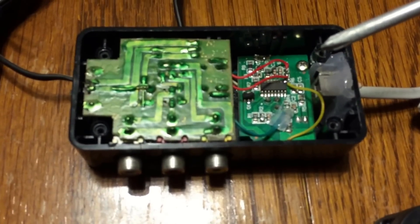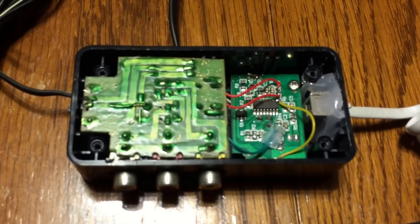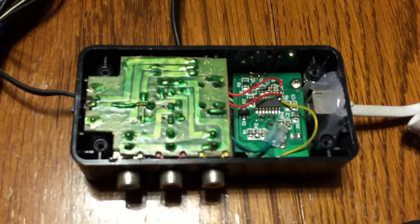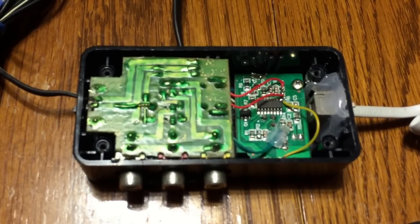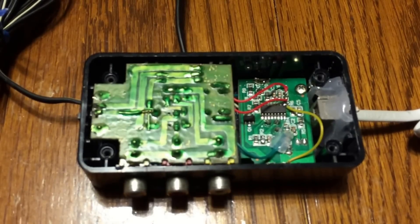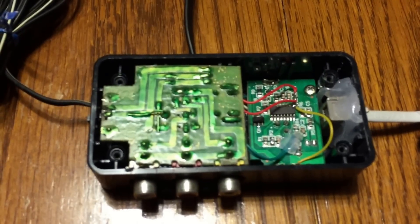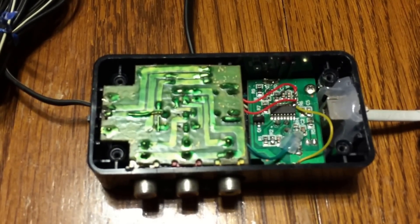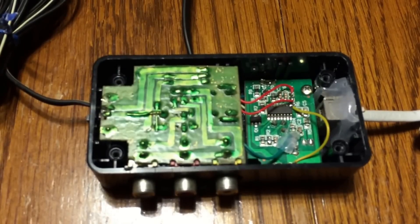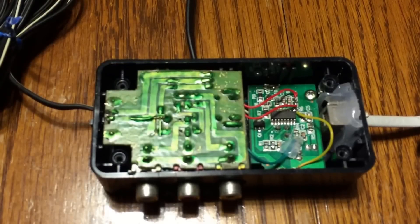I've made a couple of modifications to this board. The sensitivity was very high originally — it would detect motion 20 feet away. I don't think the lobby this is going in is even that big, so basically anytime someone walked in the door it would start playing the audio, and I didn't want that. Also, this would stay on for just over two minutes. The literature that came with the light said it only stayed on for 90 seconds, but they must have had some miscalculations in their resistor values when they assembled it — it stayed on for a little over two minutes, and I wanted a way to adjust that.